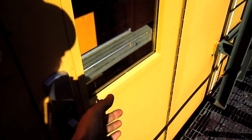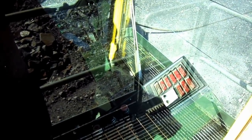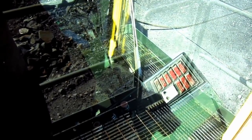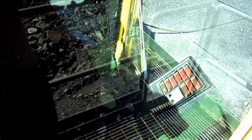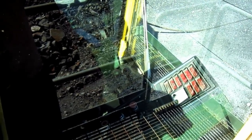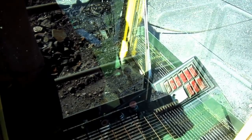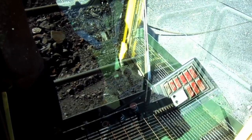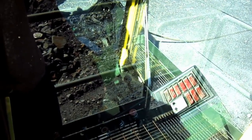Unfortunately, this machine is locked, so I will not be able to take you inside and show you around. However, from looking through the side window of the cab right here, you can get a pretty good view of what the inside of the cab on a 380W looks like. The 380W features a Ward Leonard Dynastat control system. The two hand levers to the right and left side of the operator's seat control the swing and all the digging functions of the bucket. The right hand lever controls both the hoist and drag functions, while the left side lever controls the swing functions. The two foot pedals in front of the operator's seat on the floor control the hoist and drag brakes. And if you look off to the right side control panel, you can see warning lights to alert the operator in case the machine should malfunction, along with other switches and controls for various functions on this machine.